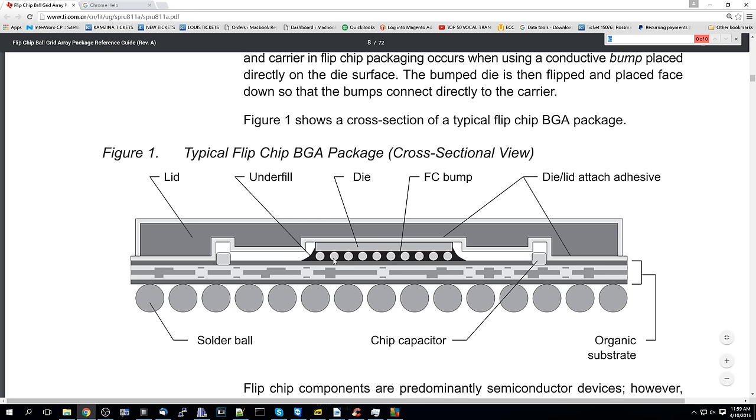But the reality is that once the underfill goes back to the position that it was in prior to you heating it, the little bumps over here are going to return to whatever position they were in that caused the chip to be broken. And when that happens, you're going to return to a chip that itself doesn't work. So while an issue in the solder balls can potentially be addressed with this heating, the issue that is happening inside the chip is something that you cannot fix.